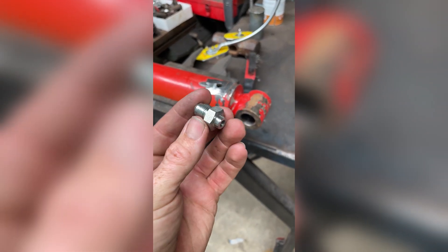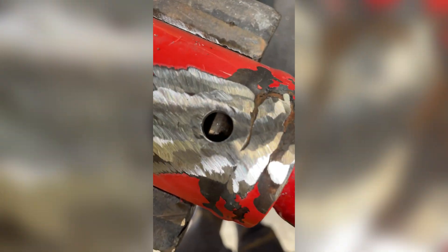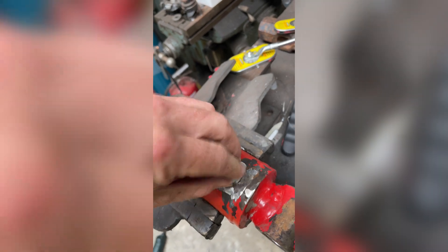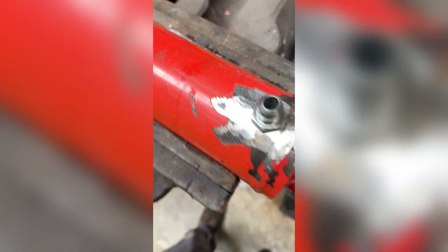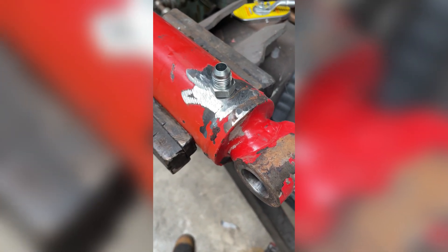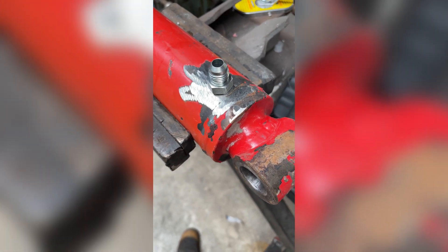That's one down. We didn't want to make it too long, because you can see where the spigot goes in - you don't want to get it too close to that because you'll block the flow off. That'll work well. Just to clean up that hex and then weld her in, but I'll machine up the other end now and then we'll weld her up.